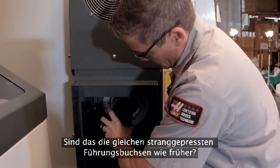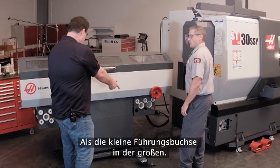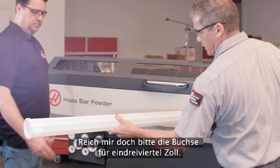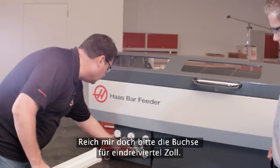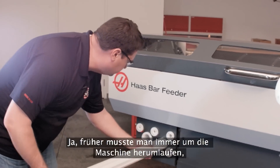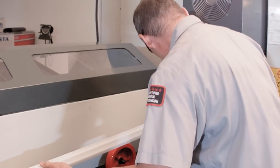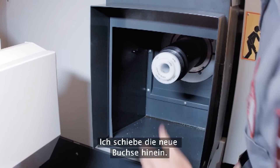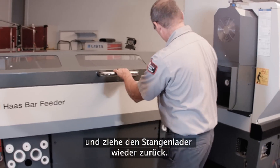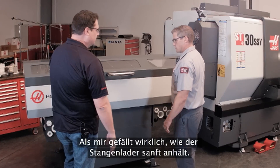Now, are these using the same extruded liners that we've had in the past? Same liners as before on the older bar feeder — the small liner inside of the bigger one. So I pull off this locking cap and I pull out my liner. If you could hand me the one and three quarter. This is pretty convenient — you've got all the liners right here on the front of the machine. Now we don't have to go around the back of the machine to get them; they're just right at your fingertips. There we go. Slide that in there, put my locking collar back on there, pull it back into position. I really like that soft close feature — that is neat. Locks right into position, ready to go.